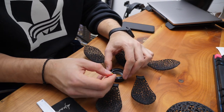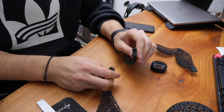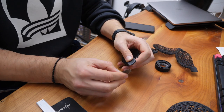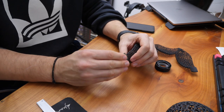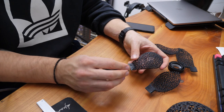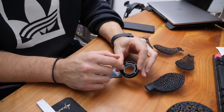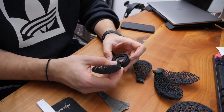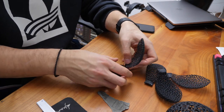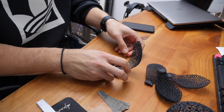With the new design we won't have that problem because we can access the bulb anytime from the top. I'm going to glue these in — I'm pretty sure they wouldn't go anywhere actually, maybe we don't even need glue. But what we've got to do is sand down a little bit because when printing with resin printers you get a little bit of an elephant's foot — that's just due to technical reasons. I'm getting rid of that. There's just a little bit left over enough to get in the way, because it's a very very tight fit.